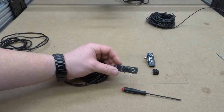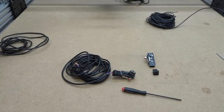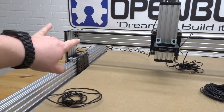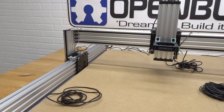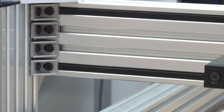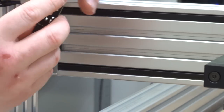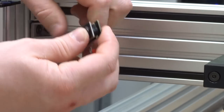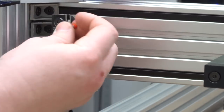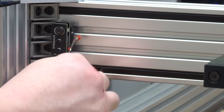For the next micro limit switch, which is for the X-axis — using the 13-foot cable — we need to connect it to the left side of the X-axis. Facing the front of the machine, at the left front position of the X-axis is exactly where we'll connect the micro limit switch. During a homing cycle you always bring your machine to the front left position. Place the X-axis micro limit switch on the front track of the C-beam. Change the position of the screw so the plunger interacts with the gantry plate, then position it right next to the cast corner connectors and fasten into place.